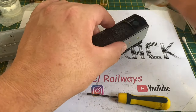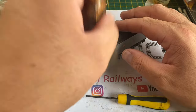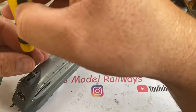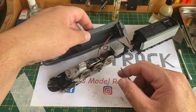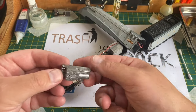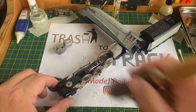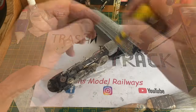I'm giving this a quick dusting as there's quite a lot of dust in the tender water filler area where the cap came off. To remove the body shell, the screw down the chimney was quite difficult to remove as somebody had drilled inside the weight inside this model and hadn't gone in straight - it was poor to say the least. The rear weight was fastened in place so I left that where it was. It's becoming apparent that working on this model with these wires everywhere, and the body shell not being able to be separated, is quite a pain.